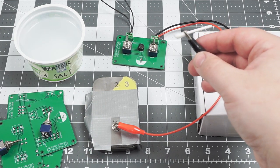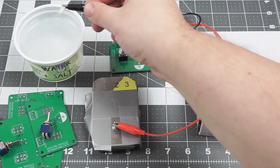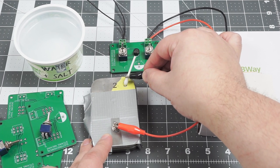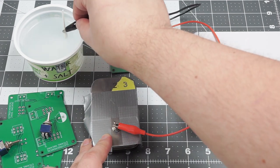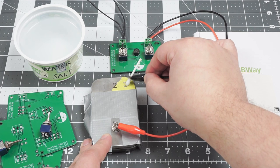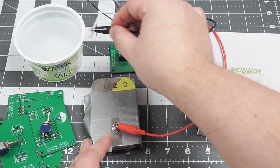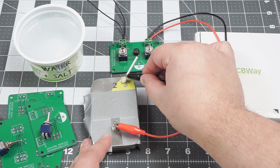One electrolyte solution just about anyone can make at home without buying anything new is salt water. Just some water with some table salt mixed in. The process will generate some toxic gases, so be sure to do this outside or in a very well ventilated area. Touch the object connected to the positive output lead with the Q-tip connected to the negative output lead for a second at a time, followed by 1 second not touching. Repeat this as many times as is needed.